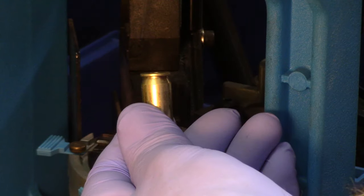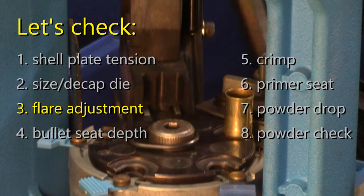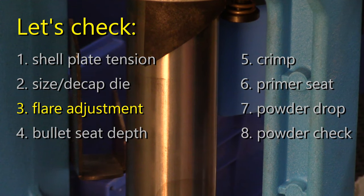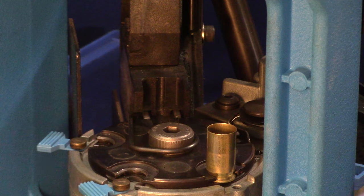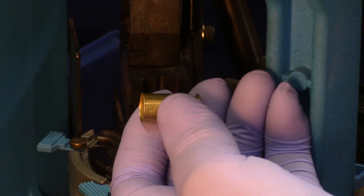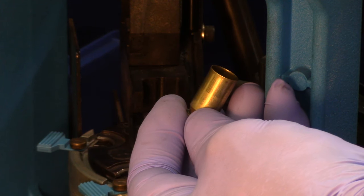Lift out the cartridge case and measure it — make sure it's the correct diameter and correct length. Once that's done, put the cartridge back in place. At the next station we will adjust the amount of flare. Cycling the handle will place your cartridge case under station two. Cycle the handle again, then take the cartridge out and inspect it — you want just the slightest amount of flare. Too much will make your bullet easy to seat, but your brass will not last through many reloads. Too little flare in the case will shave off the outside of the bullet when you try to seat it.